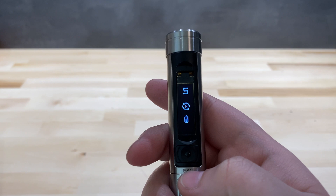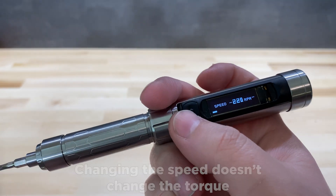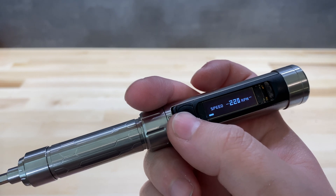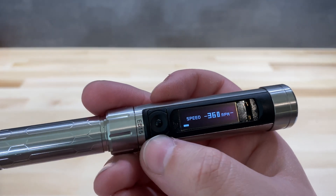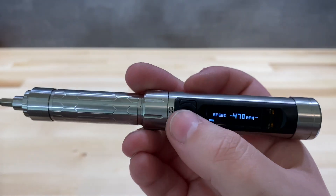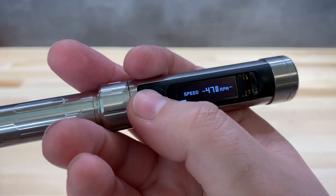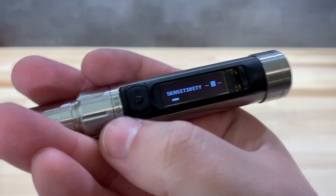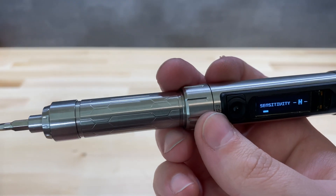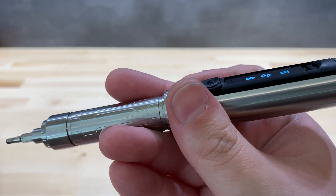The ES15 has many functions hidden in the menu, accessed by long-pressing the set button. You can select the speed — useful mainly if you use the manual rotation modes, as it sets the fixed speed. In accelerometer mode this only affects the maximum speed. There's also a sensitivity setting for accelerometer users: you can select low, medium, or high, controlling how much you physically rotate the screwdriver to achieve a given speed.